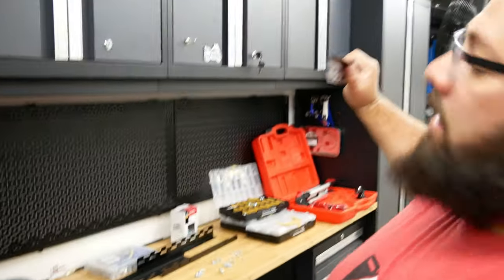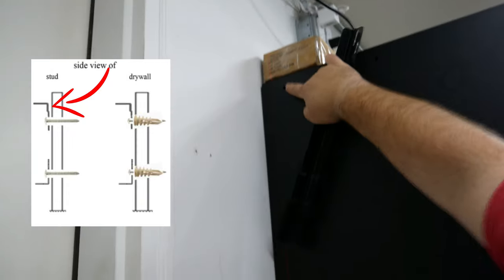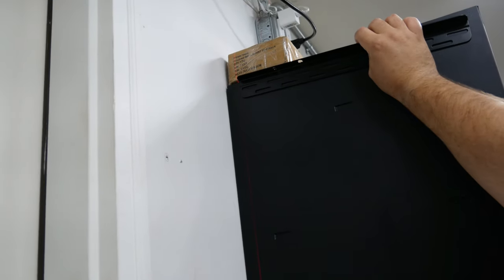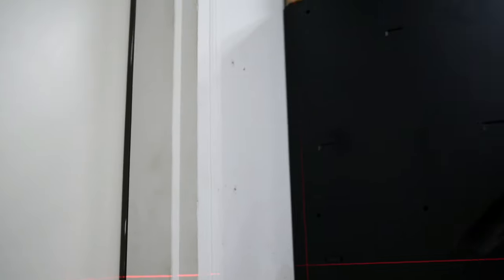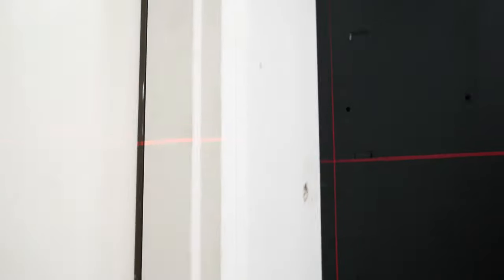So we've got the top bracket — always the top bracket has its little lip in it. I'm going to use this hole up here because I want it to go to the top. That's going to be my first hole, and this is about an inch off the wall. That'll give me an inch here — this panel is 18 wide and the stud spacing is 16 wide, so that'll be perfect.